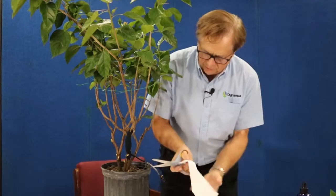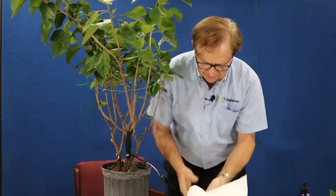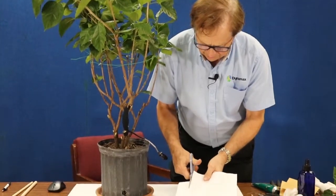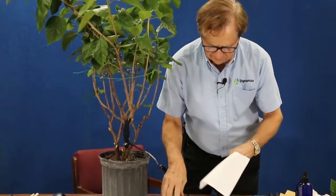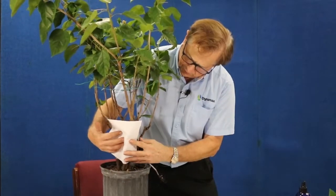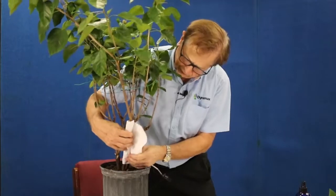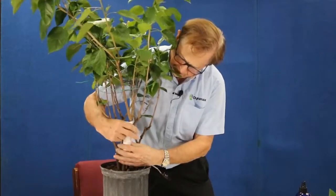So I'm going to cut a little bit off the shield. It's made to go around the entire insulating compound, but for the SGDC and the ExoSkin sensor, we only need to go around this bottom part of the sensor. So I will trim it down to right about there. I will make sure that the top is very secure and the bottom does allow water vapor to escape. All right, so it's going to be at approximately this angle here. This one could be trimmed a little bit smaller. That's approximately the idea.